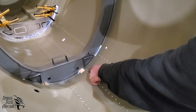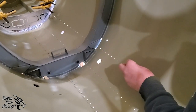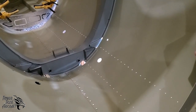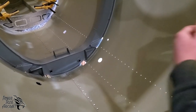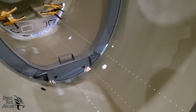And here as well. And those, if you forget to rivet these before you put the longerons in, that's fine. When you rivet this skin to skin here, it can actually be the BSPQ 42 rivets, the blind rivets. So don't panic if you saw your longerons and have forgotten that. It'll be covered by the wing fairing. Just go ahead and use the BSPQ 42s.